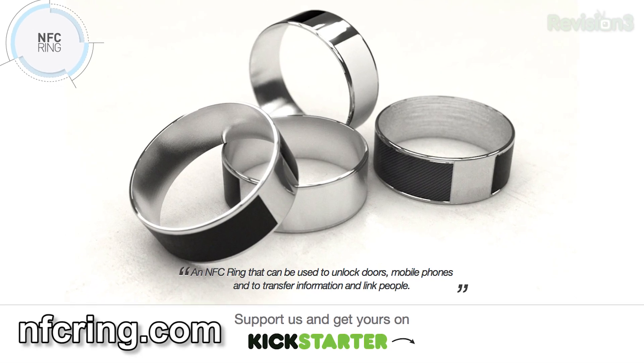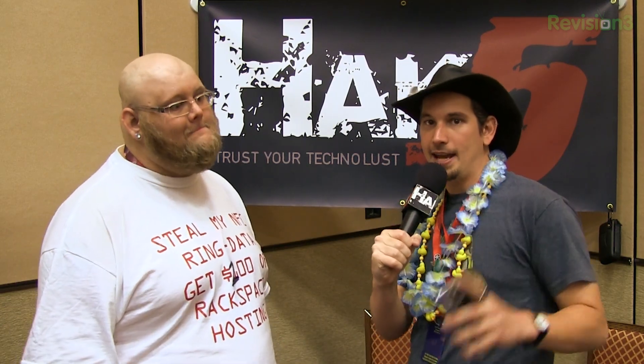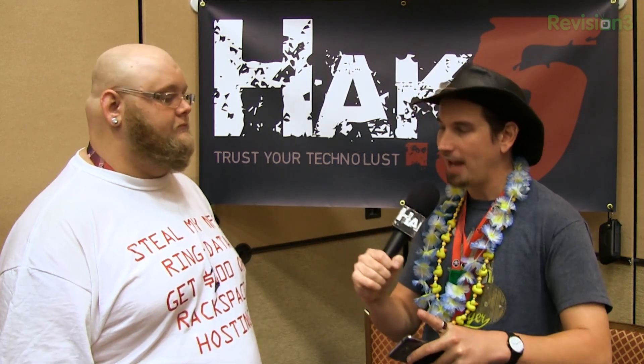So tell me about the ring. It's been really quite interesting — it's one of the first implementations I've seen that actually has some semblance of security on it. It has both tags on the same frequency, like a long-range read, you get both bits. And when we say tags, we're talking NFC — near field communications, around 13.56 megahertz. It's really low power and passive, so there's no battery inside the ring. That gives it a one to two millimeter read range, which is much smaller than most cards, because it's a special antenna design specifically for the ring.